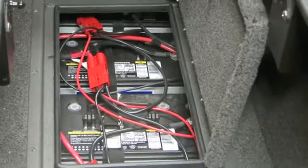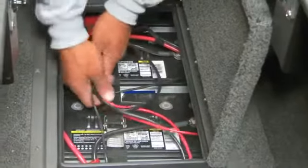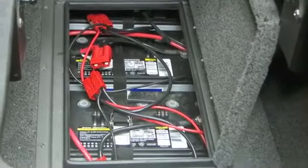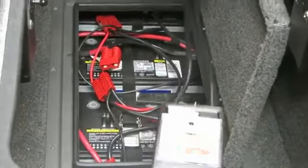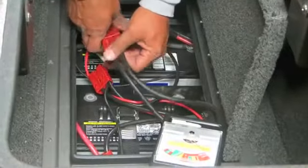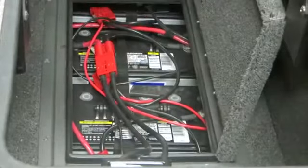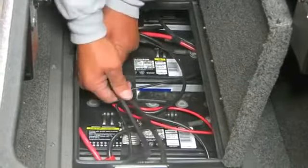There's some accessories that Connect Ease has available as well that separates this from anything else and makes life pretty simple. One of the issues when you have a 36 volt system is testing individual batteries. You have to unhook jumpers and do different things like that. With the Connect Ease system, you can simply have a tester that's wired with one of the plugs. You unhook a plug, any one that you want, plug it in. Now I have the ability to read voltage and load test batteries individually without unhooking any jumper wires that are in a conventional 36 volt system.